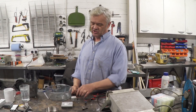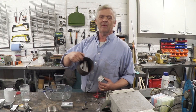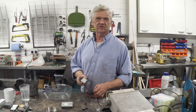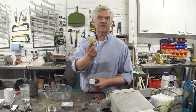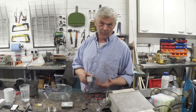Hi, so in video 1268 we took this thing and some of this and we ran a motor with it. Actually, it gave considerable generation — I think it was two volts at around 70-80 milliamps or something like that. This is a Peltier device, and you can buy them by themselves, in which case they look like that, or you can scavenge them from things like mini fridges, which is exactly what we did.